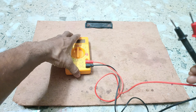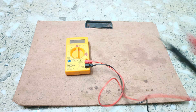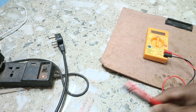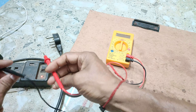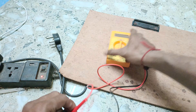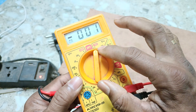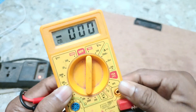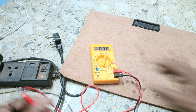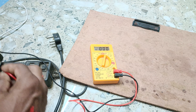Now you see how we can measure AC voltage with this digital multimeter. We have set the knob at 750 volt because we put it at the maximum voltage setting. It goes from 0 volt to 750 volt. We are now measuring the AC voltage — this is alternating current — and you can see how we are performing this measurement.